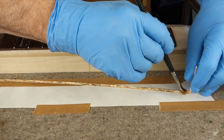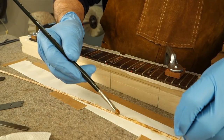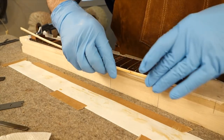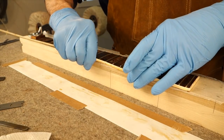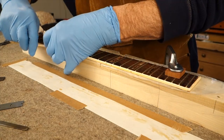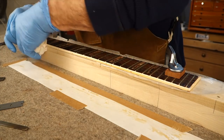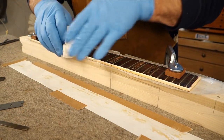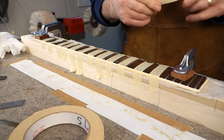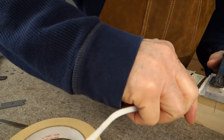Here's the messy part — that's what I made the little glue table for. You've got a lot of working time with bottled hide glue but you've still got to keep moving. This is the part where I'll stretch over any dots that are in the board — a lot of them popped out and I'm actually missing a couple of dots. Clean up as you go, get the squeeze-out. The cool thing was I could just tape it on as if it was a fingerboard being bound on the neck — masking tape becomes the clamp.